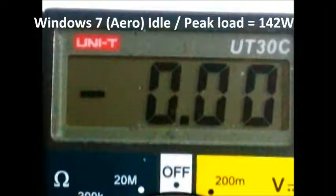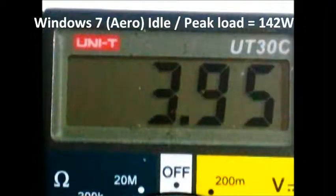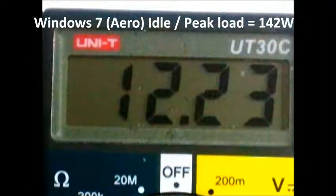So now we are actually going to measure the idle voltages. Let's start — plugging in the multimeter now. You can see the 12 volt rail there. I am using the Corsair H100, which is probably what you are hearing in the background for the CPU fan. I have actually lowered the running overclock since I am only trying to measure about 20% load.